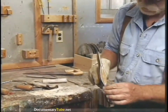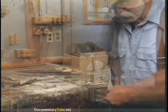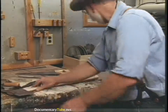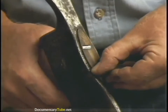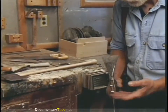Properly fixed. Properly hung. Never, never put the steel wedges in cross grain, which you sometimes see in axes. Why in the world would you want to split the grain after you've just hung an axe?